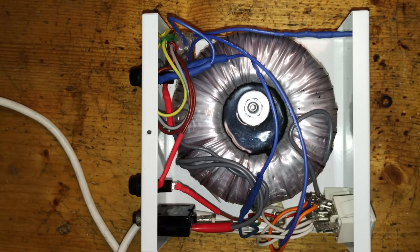In this particular implementation, the relay might have to stand a significant stress, due to the presence of the autotransformer coil. Depending on the instant in which the power plug is inserted, compared to the phase of the mains, when the switch of the relay intervenes opening the connection, there are times in which a big spark would be released, significantly reducing the life of the contacts.